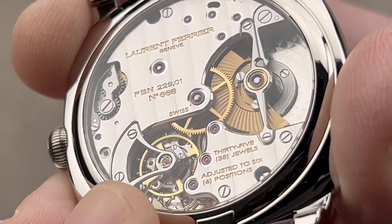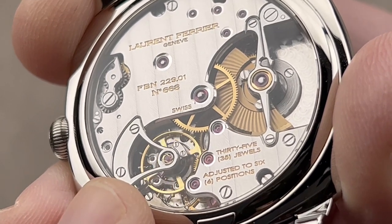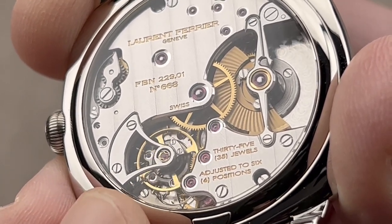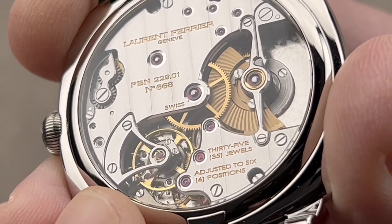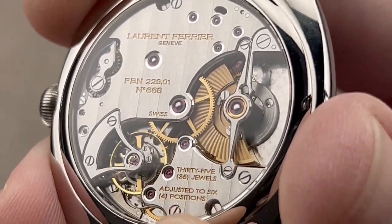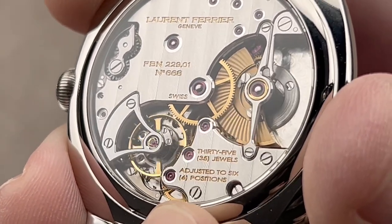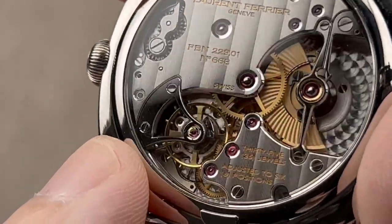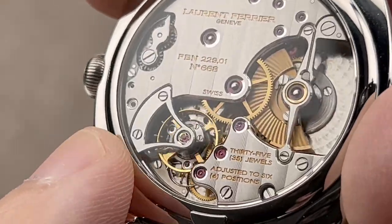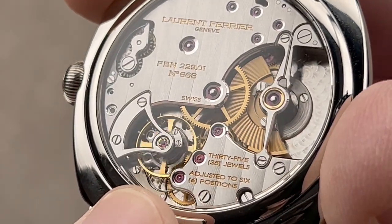We also have a silicon blocker — when one wheel is impulsing, the other wheel is locked. It's exactly like the Breguet natural escapement system of 1802, only this one actually works. It's free-sprung and adjusted in six positions, which is a super high-end standard. But you can also see that we have a half bridge for the balance made of steel, entirely black polished. There are four super sharp interior angles in there, and you'll find more on the bridges themselves.